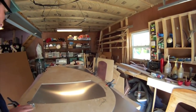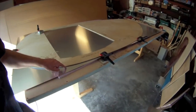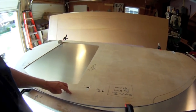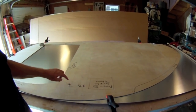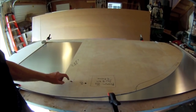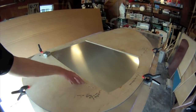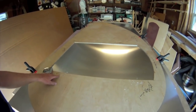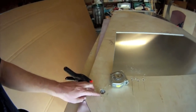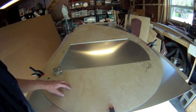Today I'm cutting aluminum for the side panels and I'm using my template. Here's the template laid out on the aluminum. I used a sharpie to trace around the edges. Where I had pre-measured and pre-drilled for the holes — for wires to come through — this would be for the porch light, the running lights, and also for the hinges. I had pre-measured these on the template and drilled holes to mark the locations, so I've gone ahead and drilled where the wires will come through. Next I'll take the template off and get to cutting the aluminum.